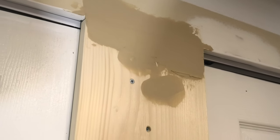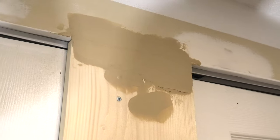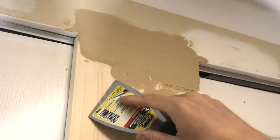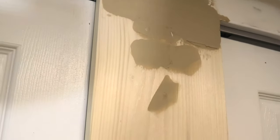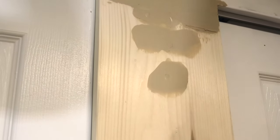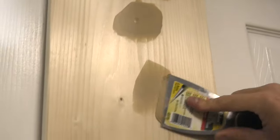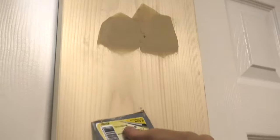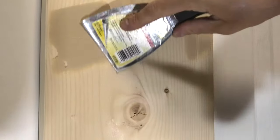The smaller holes can take up to 6 hours to dry. Deeper areas like the gap between the wood and the wall may take a whole day, so it's a good idea to leave it for a day and then come back and start sanding. When you press it, make sure that some filler actually comes out from the holes. I'll fix some minor holes and go over each knot, covering it with the wood filler first, and then we'll use the shellac-base primer to seal them afterwards.